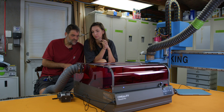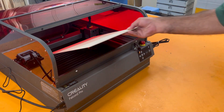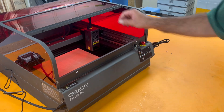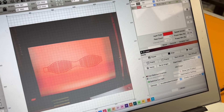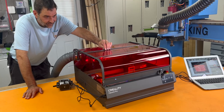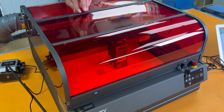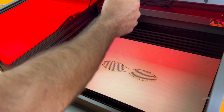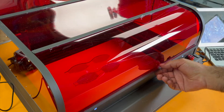Let's give it a go. We're starting by cutting a living hinge bow out of eighth-inch thick plywood. To focus, you slide the little piece under the laser head, set the head on top, and tighten it into place. The living hinge bow is a great first test because it's intricate and produces a lot of smoke — perfect for testing the cover. We pulled the cover back mid-cut just to see, and it really did contain the smoke well, with the exhaust fan pulling it outside.